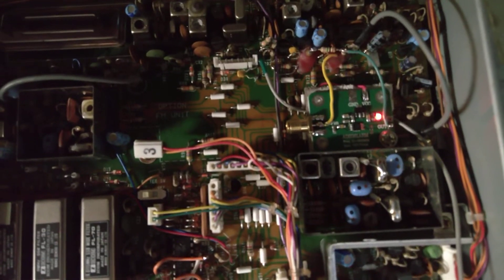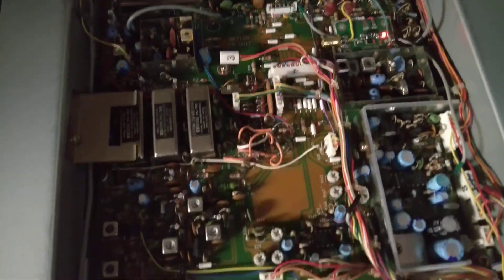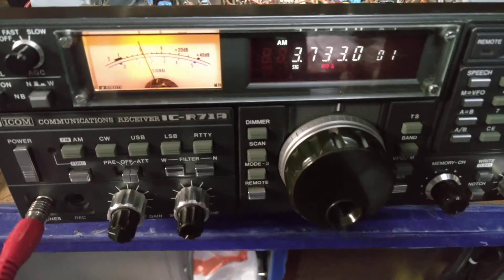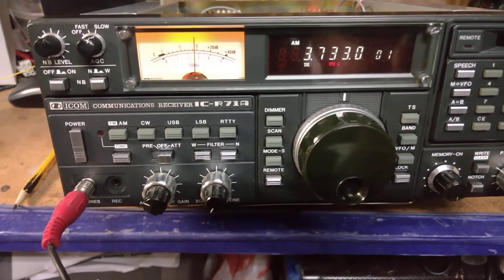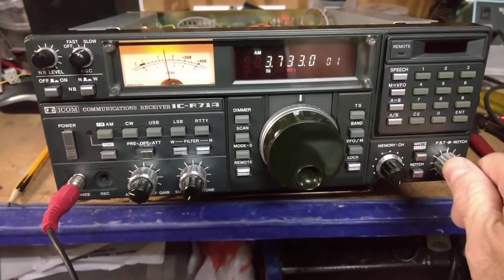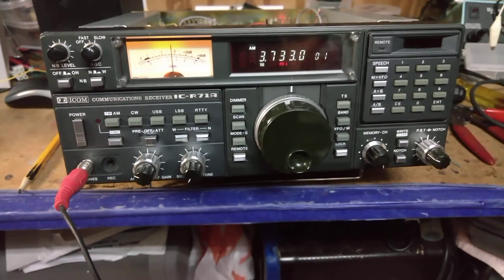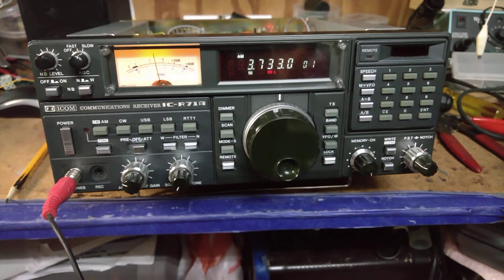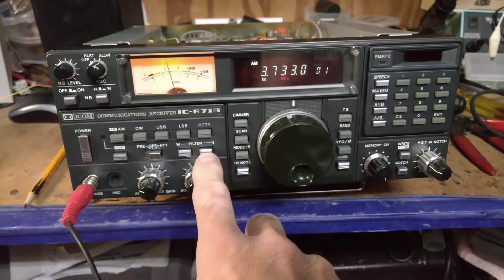A very long but very low altitude long wire for receive as a low noise antenna on 160. You can do that here, but what do you do at the other end — do you terminate it in a resistor? It seems like a thousand ohm resistor or something to ground at the far end is all you really need. The antenna should be about 10 feet up in the air, just played out toward the direction you want to receive. That's pretty much the basis of it.